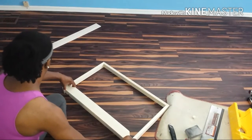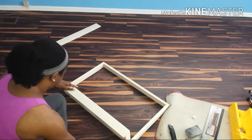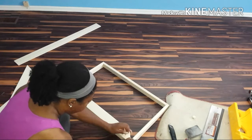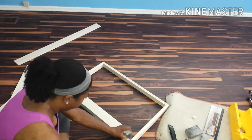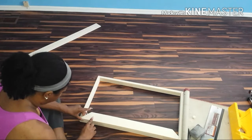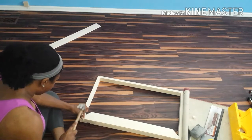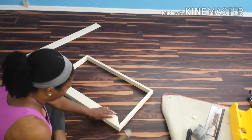To complete the frame, we're going to add the front panels to help conceal part of the air conditioner and give us a sturdy place to apply our metal sheeting. Go ahead and nail the 27-inch pieces to the long parts of the frame and the short pieces to the short parts. I'd suggest nailing one corner but not all the way, then going to the other corner to make sure the panel and frame line up, then hammering all the way through. I added a third nail in the center for extra sturdiness, since the front panel aspen is only one-fourth inch thick and is very lightweight wood.